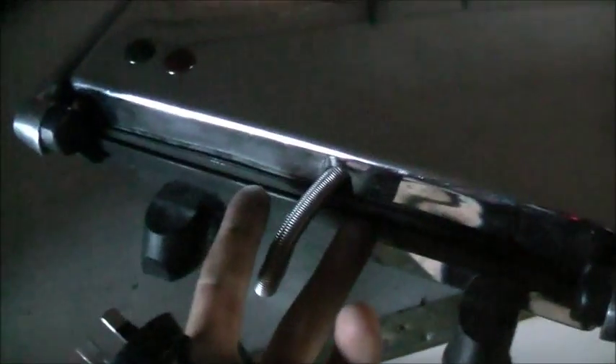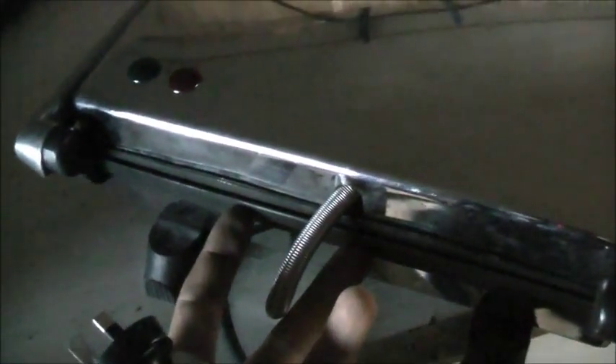I may just run the extra neutral wire through there. One's got active and neutral already there. The other one had to run another wire to get the neutral on this other heating element. So let's do a couple of pre-checks, make sure everything is good. I'll set the multimeter here to continuity. Start with earth — then earth to active.